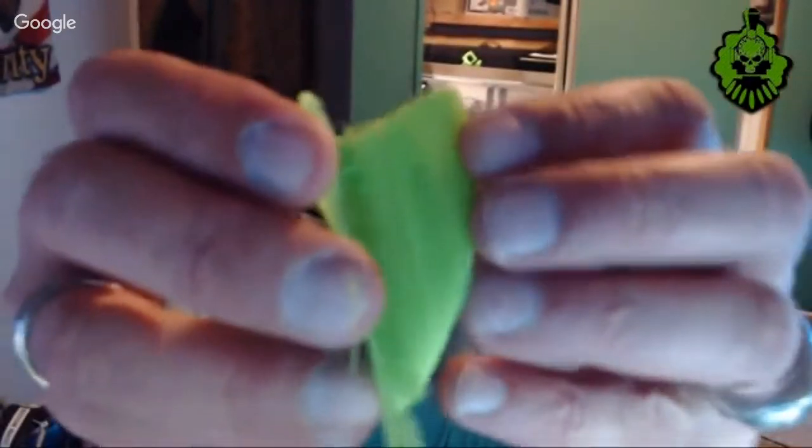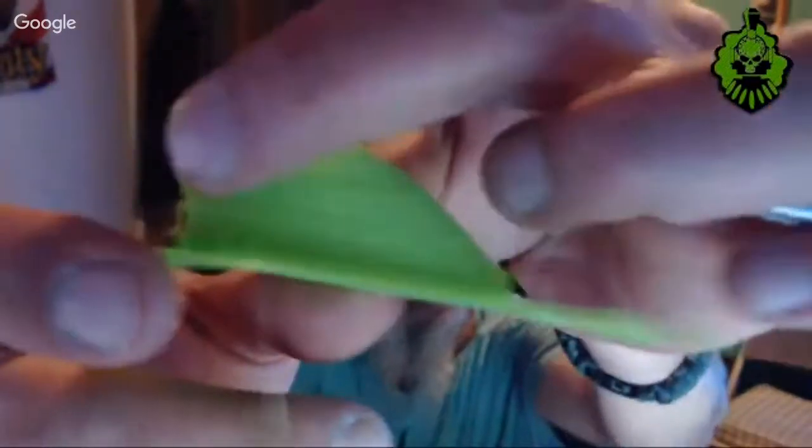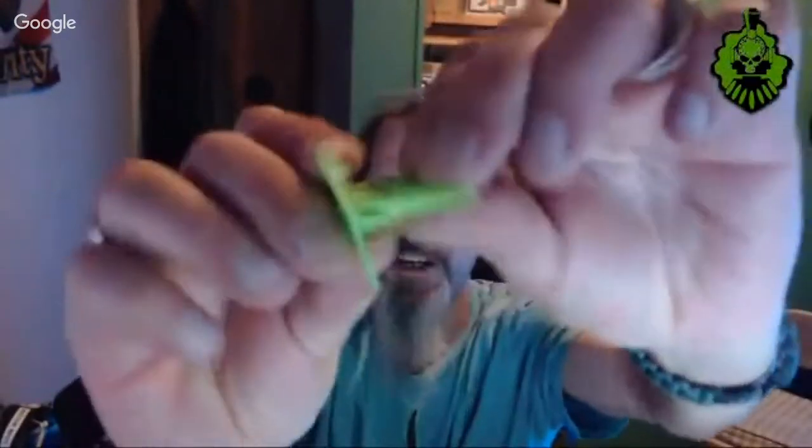So you can use it for, say, a project that broke like this one. Like I said, it had some seams that were splitting apart. So I seamed it. Basically just ran a bead all the way down the seam, nice and thick in there. It basically just melted back together, so now it's a full top again. No breakage. So if it's on my quad and the seam breaks, or if it takes a good hit and starts coming apart, I can take that pen, the colored PLA, TPU or whatever, and run it on in there.